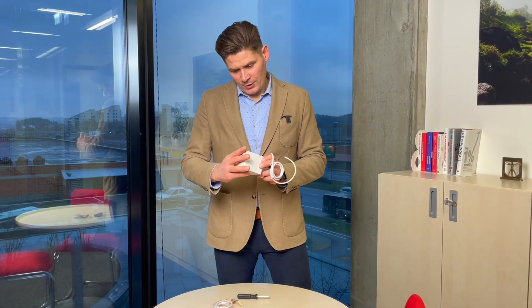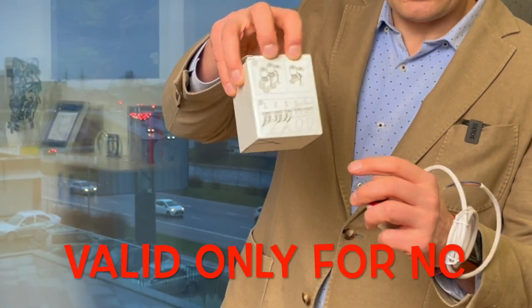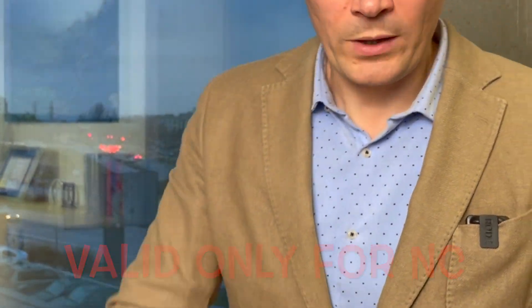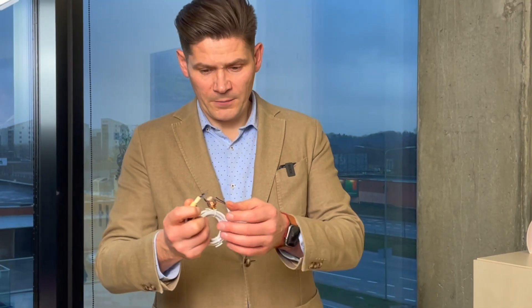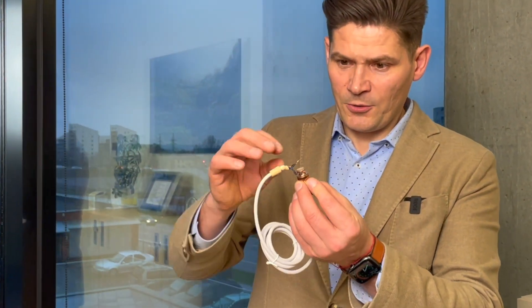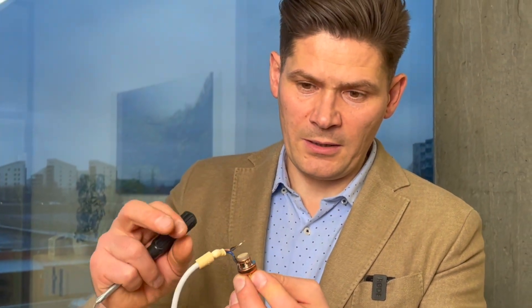As the instructions say, for normally closed actuators you need to take the red knob out before wiring. This is important because inside the thermal actuator there is a small thermal engine which has no fixed contact with the thermal elements. This thermal heating element, after getting electricity, heats up the engine and the cylinder comes out, then closes or opens the valve.